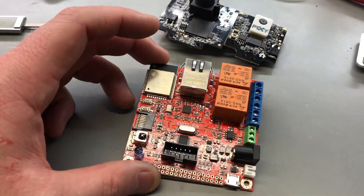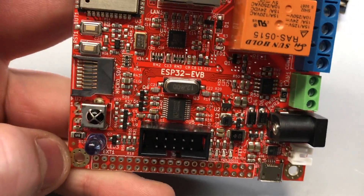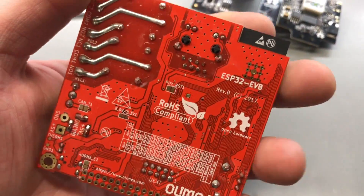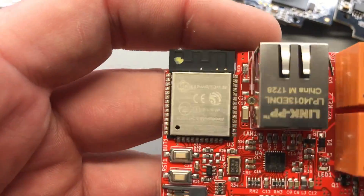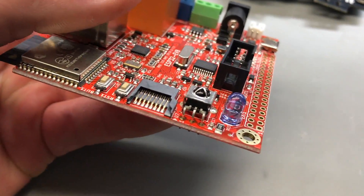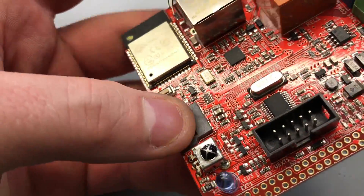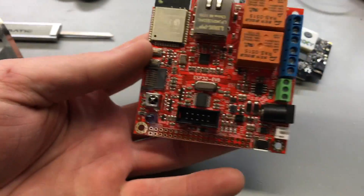Aside from the new encoder brackets, I've also decided to use this board that I found. It's an open source board — the ESP32-EVB by Olimex. What's really nice about it is it has ethernet or Wi-Fi, it's got the ESP32 right on it, and it has two relays, an SD card, and an IR blaster. If I want, I can remove some of this stuff, and because it's open source I can end up making my own board if I need to free up a few more pins.